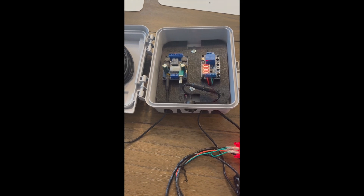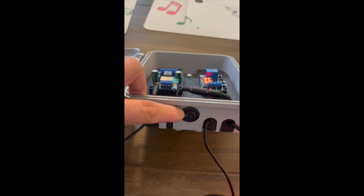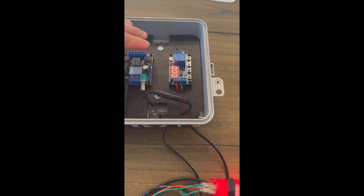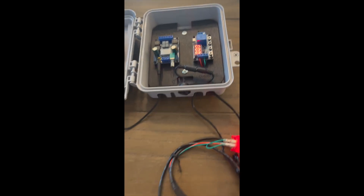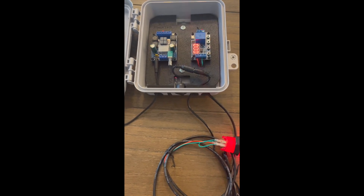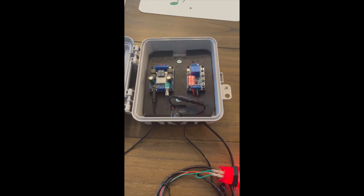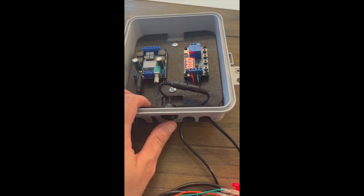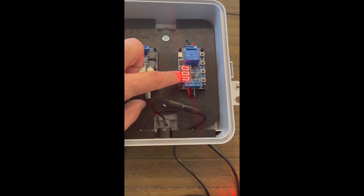One of the newest improvements I made on my push-button setup is the override switch, which is on the bottom of the enclosure. This override switch overrides the relay and allows the amplifier to run as long as the switch is on. This is great for days such as Halloween night or Christmas night where you want the system to run throughout the night or until a certain time without anyone needing to press the button. As you can see right now, the amplifier is not on because the green light is not on. However, when we hit the switch, the amplifier turns on regardless of whether the relay is counting down.